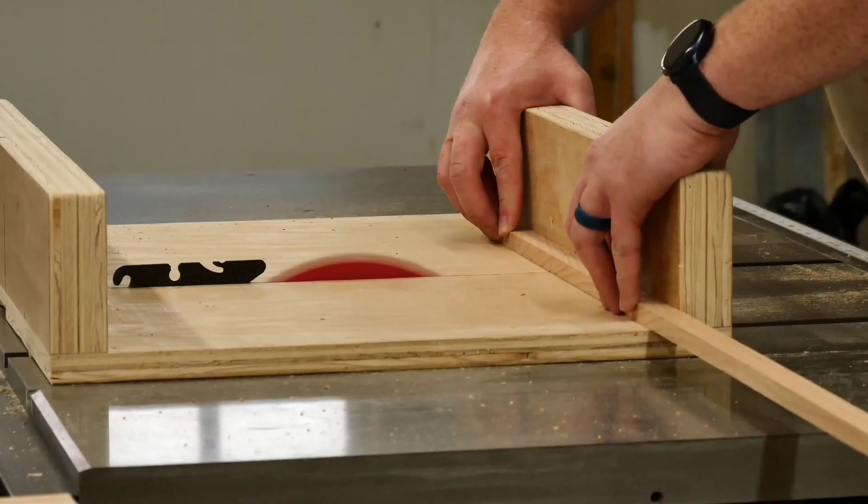Once the wood filler was all dry, I gave the whole piece a good sanding, focusing specifically where all the edges meet up, just to ensure a nice seamless transition. Once that was done, I got the router back out and put a three-eighths roundover on the front and the two side edges. I didn't record it, but I lightly hand sanded everything before installing the top piece. To install it, I got it all lined up correctly, clamped it into place, then pre-drilled the holes and drove in some screws through those support strips into the top. I used two screws per strip for a total of four across the front and four across the back.